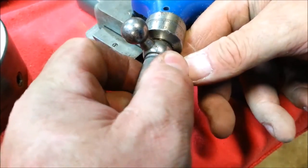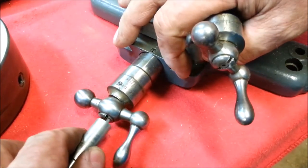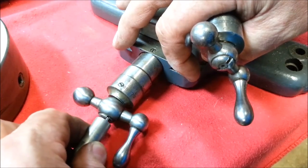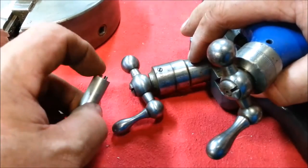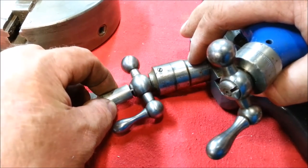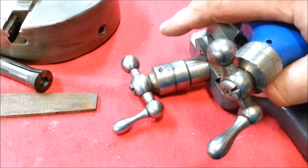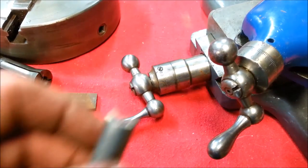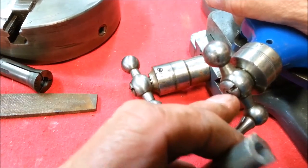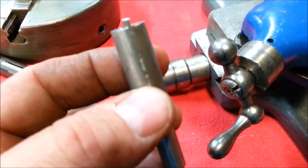I think that'll do it. It's not seating all the way in, but that's a little bit of a damaged slot. Seems to go into that one farther. Very good. The reason for the length of this is the dome here — could maybe make that just a tad shorter. Perfect. And the reason for the hole being drilled is the studs in the center there — these need to go around it. Now I need to put a T-handle in this so I can manipulate it.